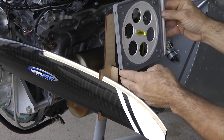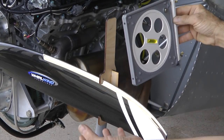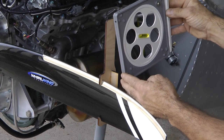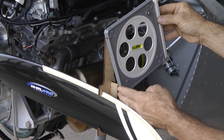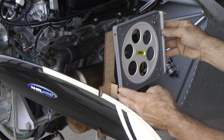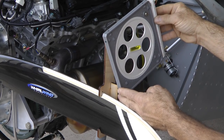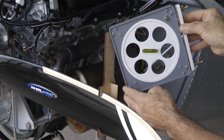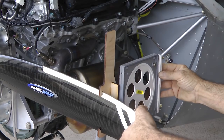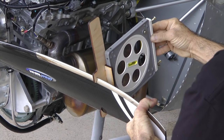I know I'm going to tip the front of the propeller in this direction. If I tip it, eventually it's going to go level — that means yes, I did it right, I went the right direction. Now my tool is set up to be used. I'm going to tip the blade until the bubble gets in the middle. When the bubble is in the middle, I'm at 20 degrees. So I'm going to turn the propeller until the bubble is in the middle.